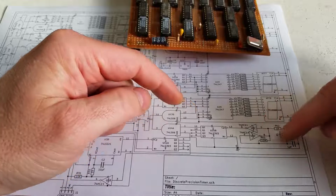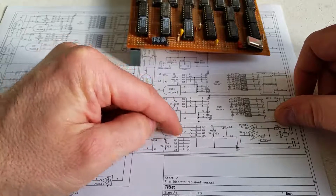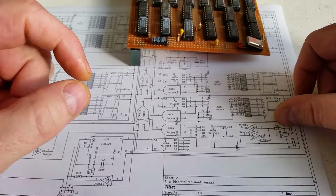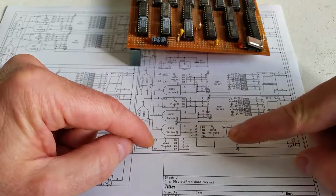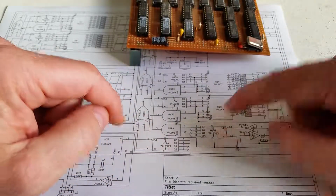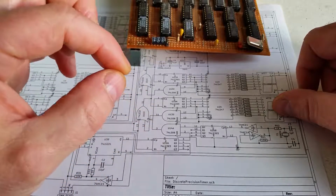So the oscillation happens all the time, but what I can start and stop here is the 10 megahertz count. There's 2 inputs to that AND gate, and the other input comes from something which I can actually control, switching on and off, and it's the other 393. In the 74393, there's 2 counters, and this is the other counter to that one. That one does the divide by 2, but this one doesn't. This one's like a sequencer.